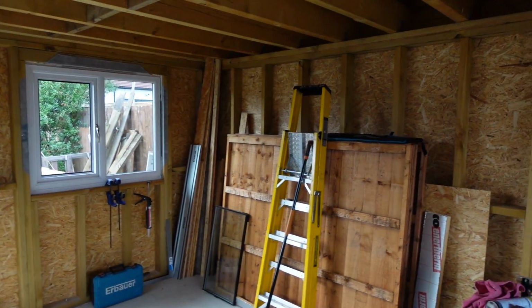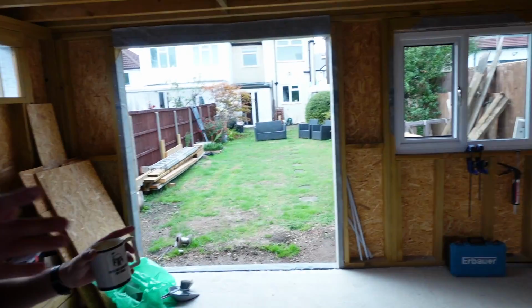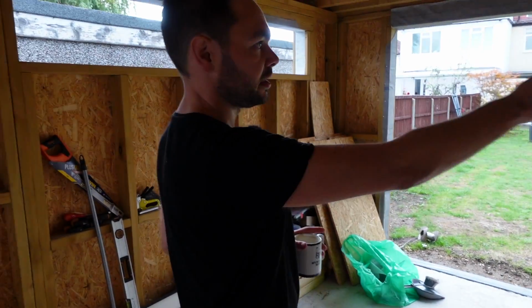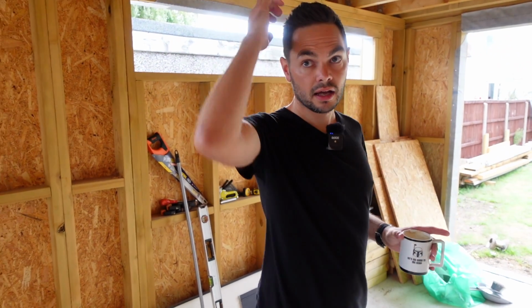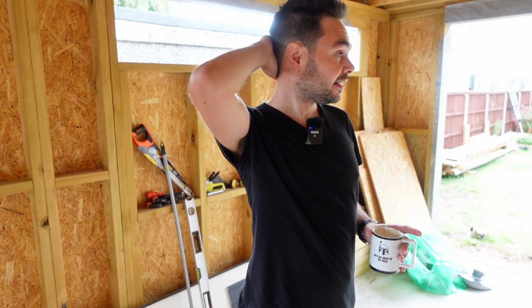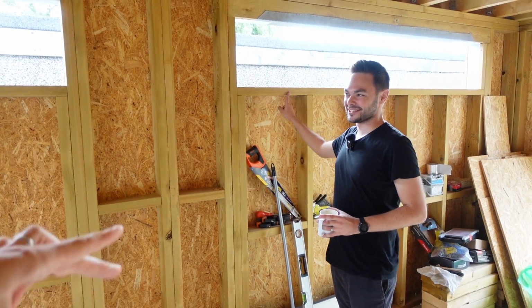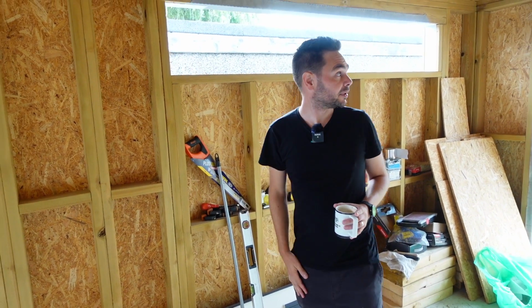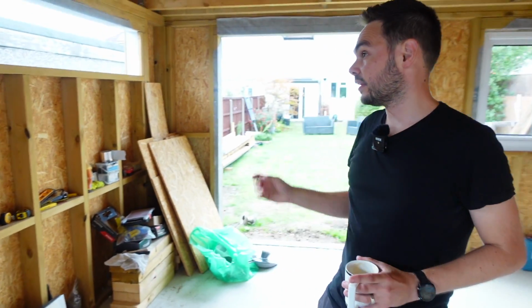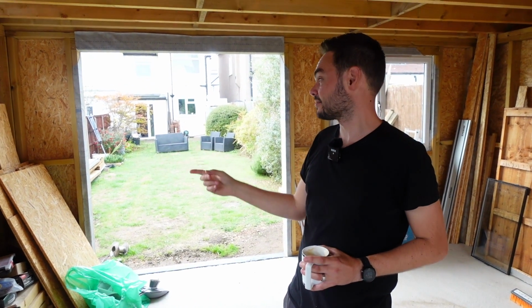Isn't it? I mean, you put the stud walls up and they go up quick. You frame it up and then we did these three and lifted them in. Oh, okay. So you laid them flat? Yeah, Canadian style. Even with the window, you framed out the window. That's when I changed my mind and I wasn't going to do it again because this one was heavy. Yeah. But yeah, I did that, and then I had the Lewis boys and Curtis round, and we lifted those